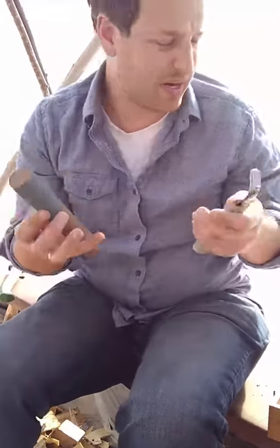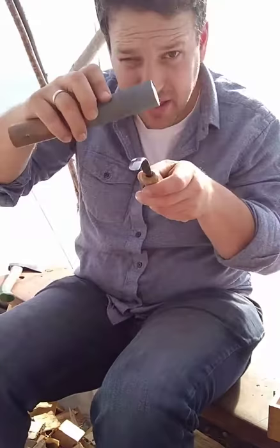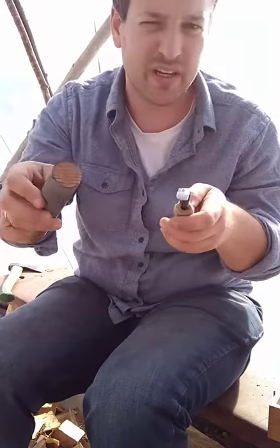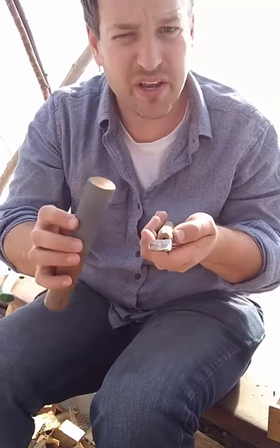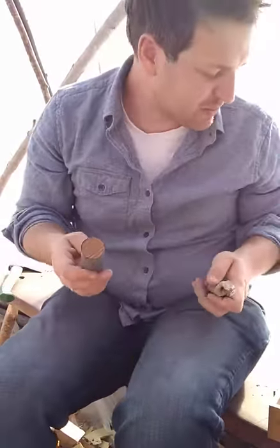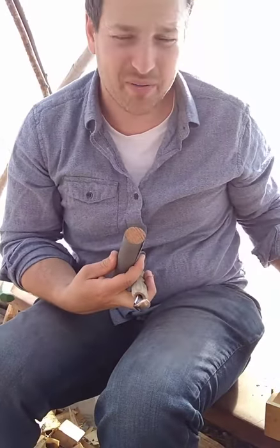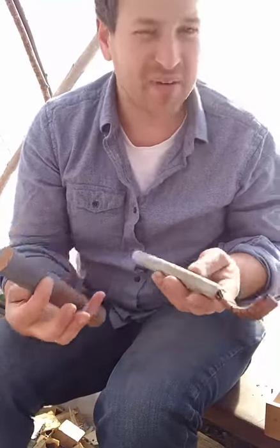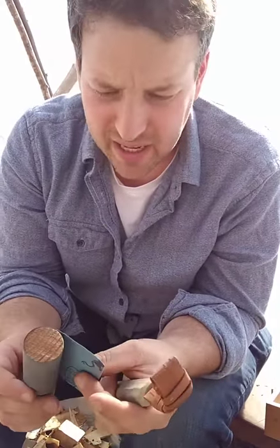I do the same thing on the inside and then on the outside, and I only do the outside with the 3000 at the very end. There's no point in knocking off the wire edge created by all the different grits — you just wait until the end. I'm a lefty too. I think Nick comes up with the way that works for him and he sharpens way more tools than I do, but this works and it works lovely.